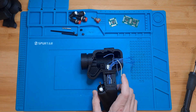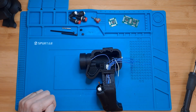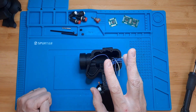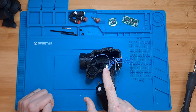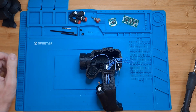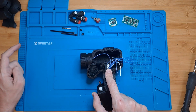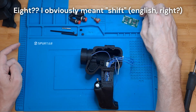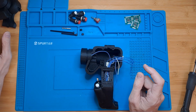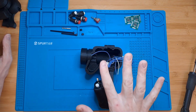For the right grip, it has 23 digital inputs plus the joystick, which provides two analog inputs on a separate circuit. For digital inputs it has 23. The left one has 32. That means the right grip needs three 8-bit shift registers, and the left grip needs four of them — and they all fit inside this cavity since these are very small.